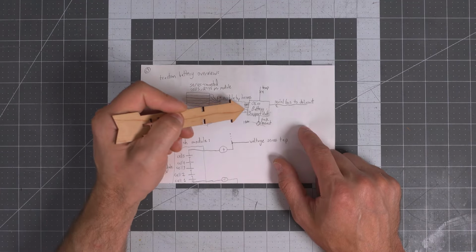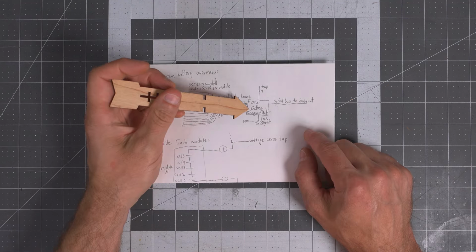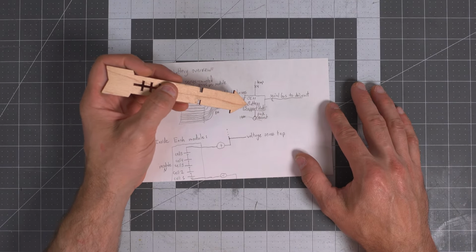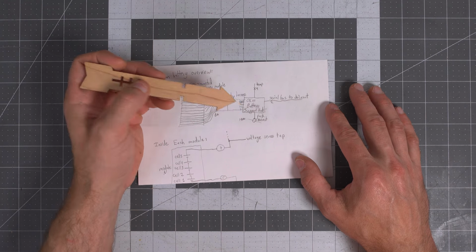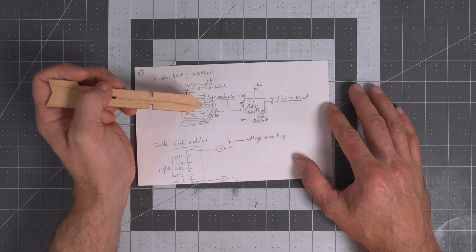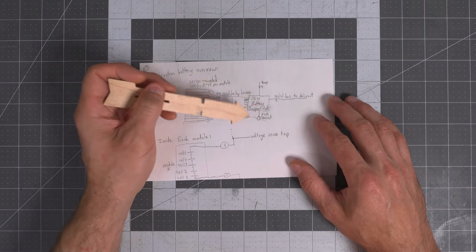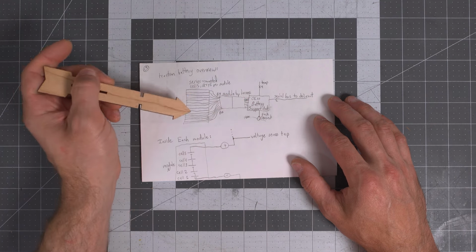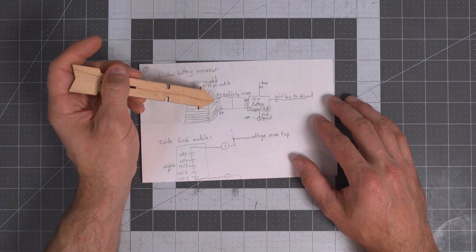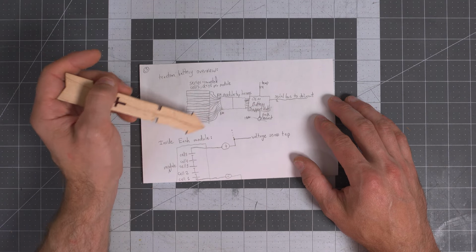So then this temperature harness plugs into what's called the battery support unit, the BSU. In the nickel metal hydride Prius, this is not a battery management system. It doesn't manage the battery so far. It actually just tells when the nickel metal hydride cells are totally shot. It doesn't have balancing or anything like that in the nickel metal hydride unit. When you put lithium in here, you don't replace this unit. Project Lithium has added a harness that plugs into this so that we can tell if a cell is over or under charge.